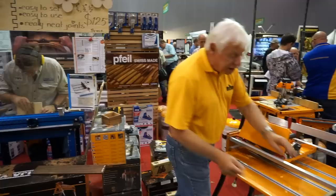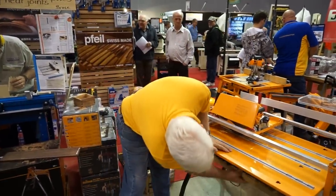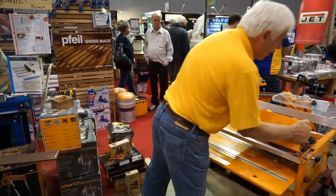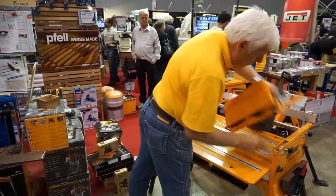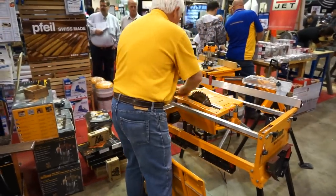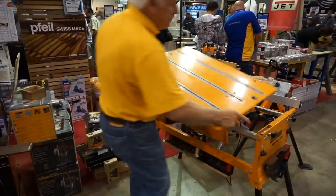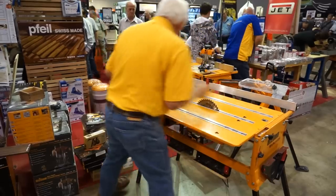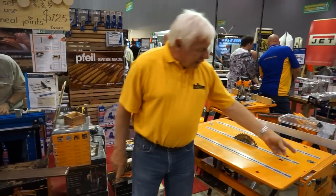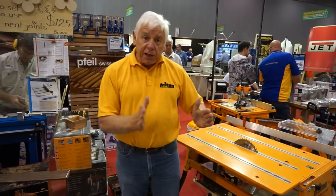If you just watch — it's not difficult. I take this off here; it just clips off with those red tags, and it has somewhere to go so nothing is dropped on the floor. Then I lift the saw off out of its track, take the table out, and flip the table over. When I put the table back on, it's guided into position by these catchers, which are slightly wedge-shaped and centralise the table to get it exactly right.